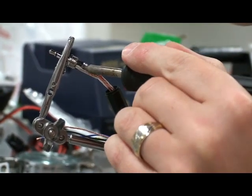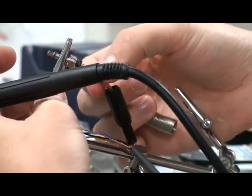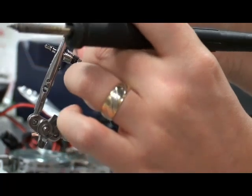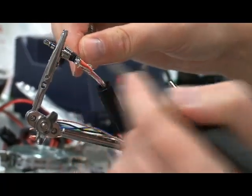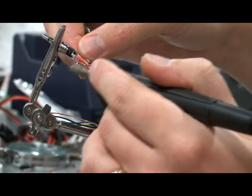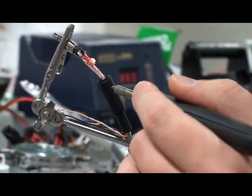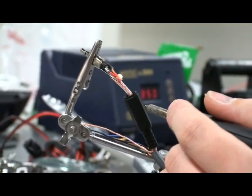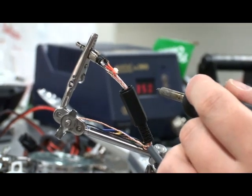If you find that after pinching the cable with this metal thing here, once you pinch it, it's actually too low, it might not be a bad idea to run some insulation tape just like so around it and then wrap it from below to prevent any kind of breakage, because once again this thing is going to be inside of the speaker under a bunch of other stuff, and if that thing breaks, that means you have to disassemble most of the speaker to get back to it.